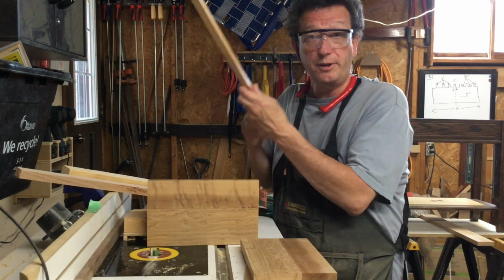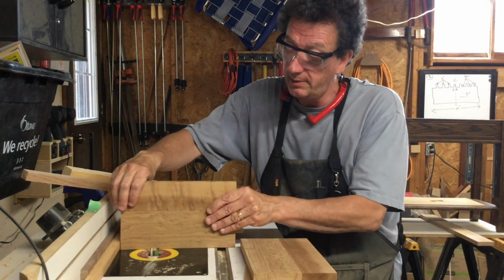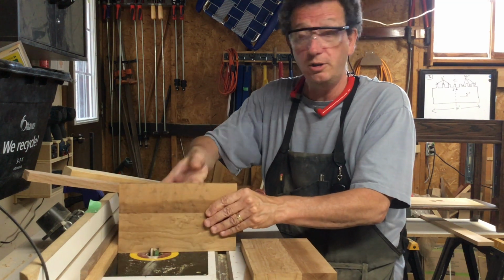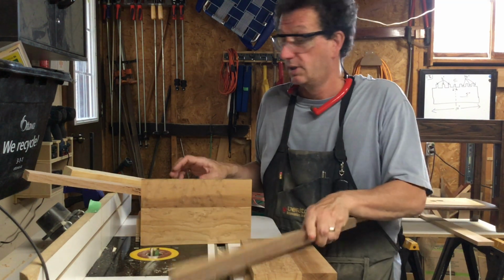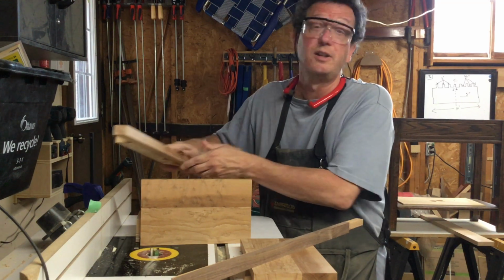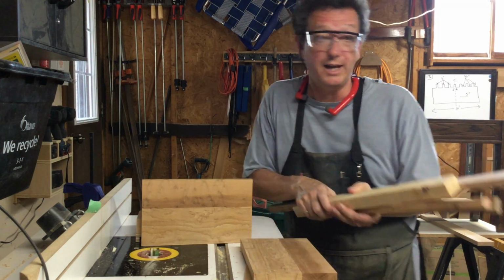And then I have a 3/4 inch thick piece. I'll put that against this. And that will make the alignment for the router bit. Cut 1, 2, and I'm good to go. To make the second set, I need twice the thickness. So I made a 1 inch piece and a 1.5 inch piece. Do that set, and then I add these back for the final set. So that'll get the spacing correct.